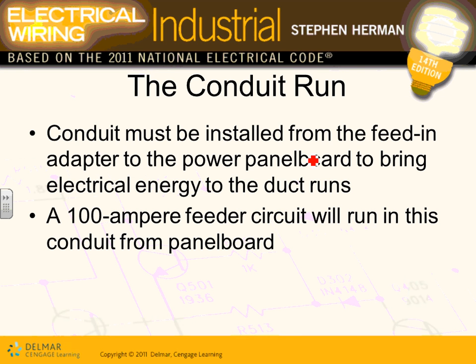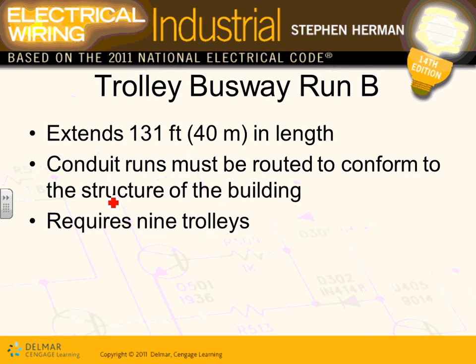So let's see how many trolleys we have in each one of them. The conduit run must be installed from the feed-ins. So then they feed the trolley with the conduit, guys. Feed-in adapter to the power panel. It is a 100 amp feeder. So you bring a 100 amp feeder to a junction box that attached to part of the trolley busway, and you feed that trolley busway with a 100 amp feeder wire and conduit from that particular panel.